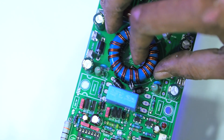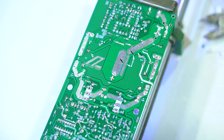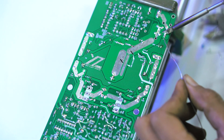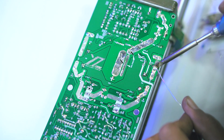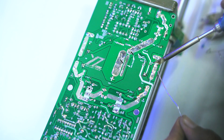The inductor is wound 19 turns to achieve an inductance value of 33 microhenry. For the bottom solder pads, you can add extra solder to strengthen the traces. However, the areas I have marked do not need additional solder — the HASL from JLCPCB is already sufficient to reinforce those traces.